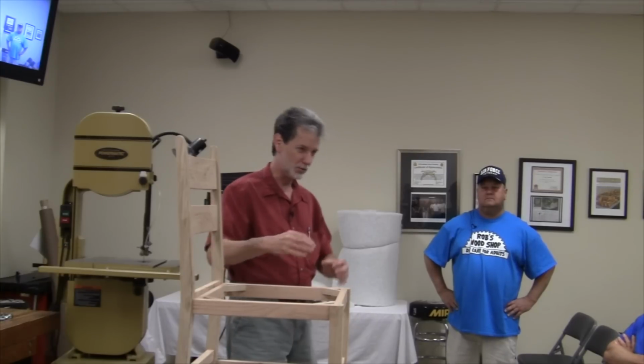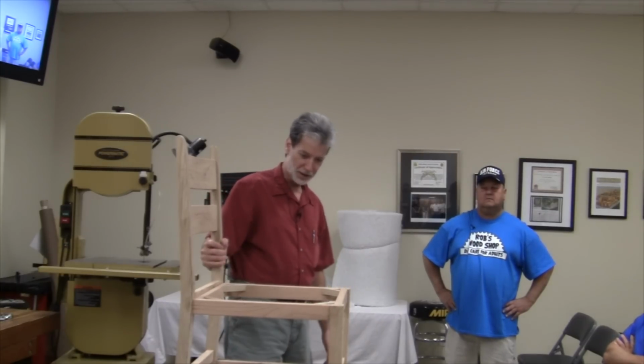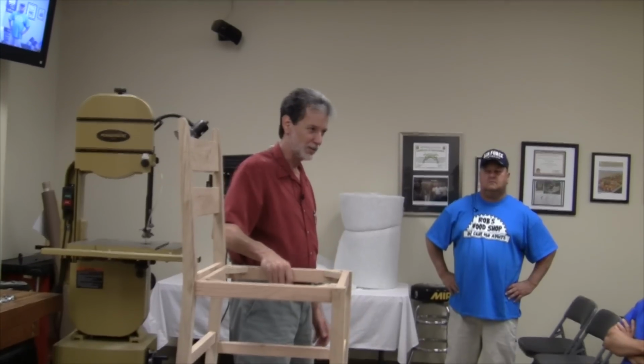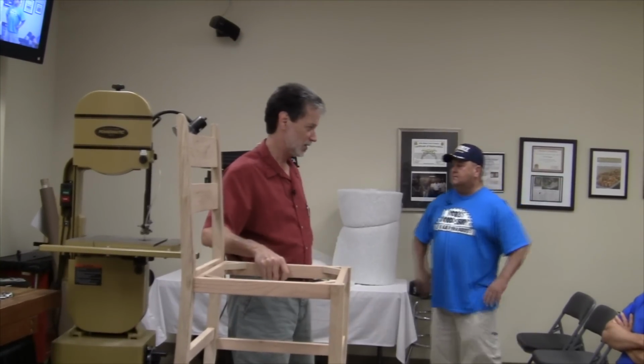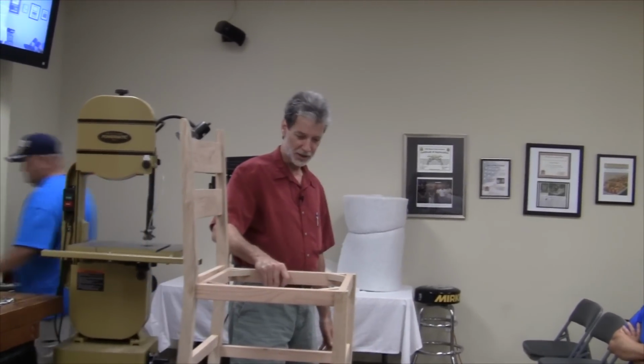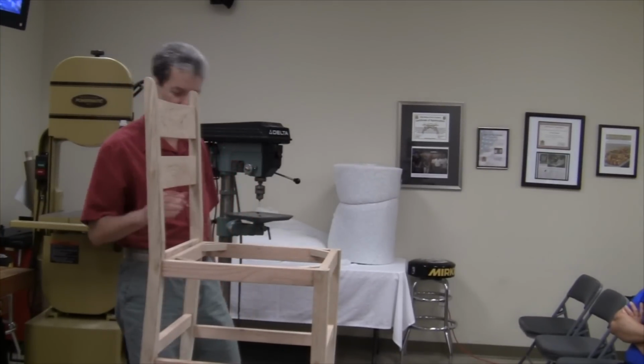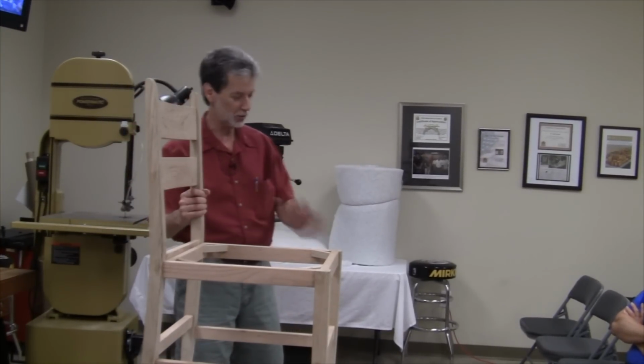Sticks of wood. And made some holes and some tenons, and we put them all together, and we ended up with a nice, stable, very solid, everything square, very functional chair, which is going to be one of six. Got the clamps all off, the glue's dried up. At this point is where we would normally do our hand sanding.